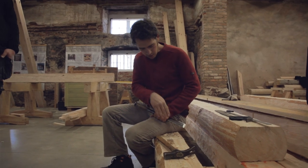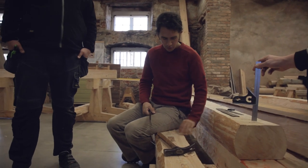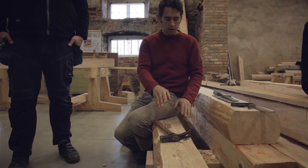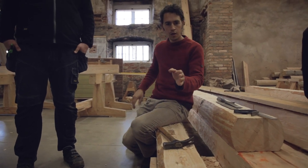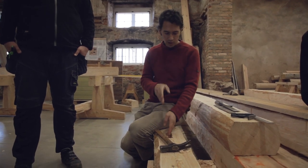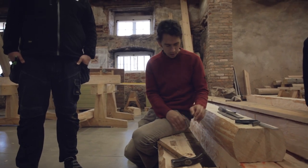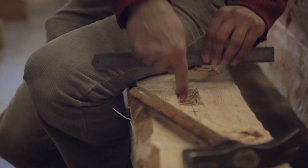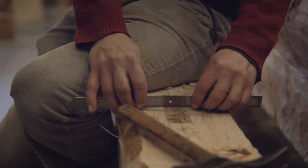If you look this way, you will dig this way. So you need to have the check. Here, in this case, we did not make two axes. So at the end of the beam, we can't have an axis to plumb it. We could check with a plumb. Of course, we can do it this way, or what I often do is I check if I can see the end of the end.